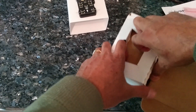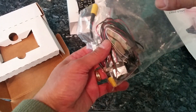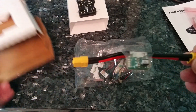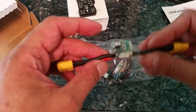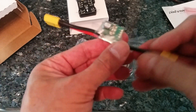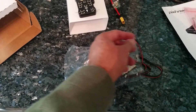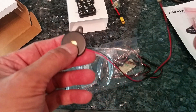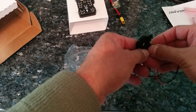There is more stuff in here. A comprehensive bag of cables and bits and pieces. I can recognise the power module straight away — some people use it, some people don't, but with the Pixhawk you're pretty much encouraged to use it. I think you can go up to 4S batteries with this — if you want to use it with anything more than 4S I'm not actually sure what you'd do. It also comes with a buzzer — the Pixhawk has a small internal buzzer but this external one you can mount somewhere. Made in China — where else — and everything connects to the Pixhawk using these little Molex connectors.